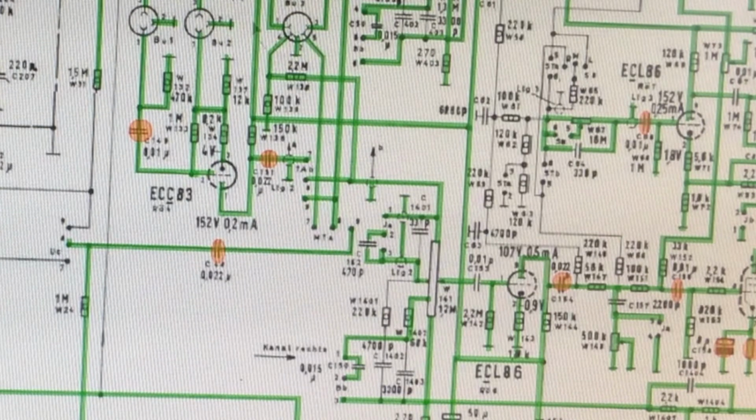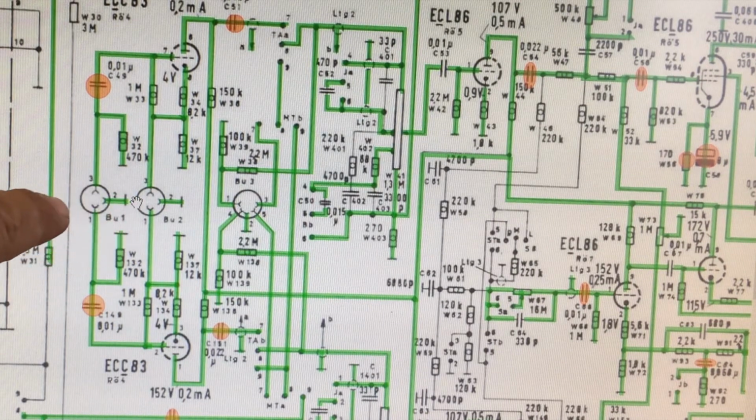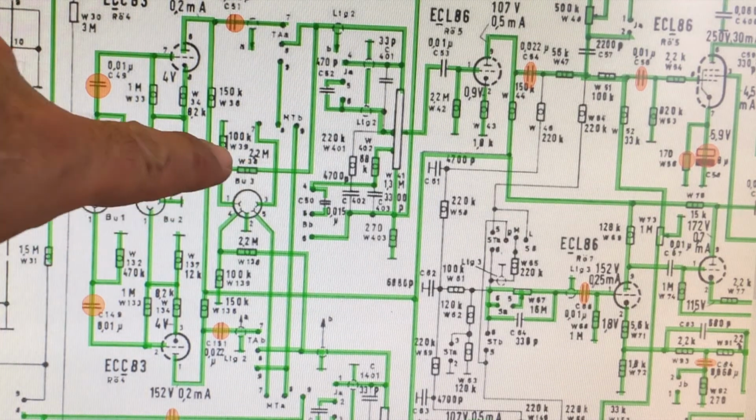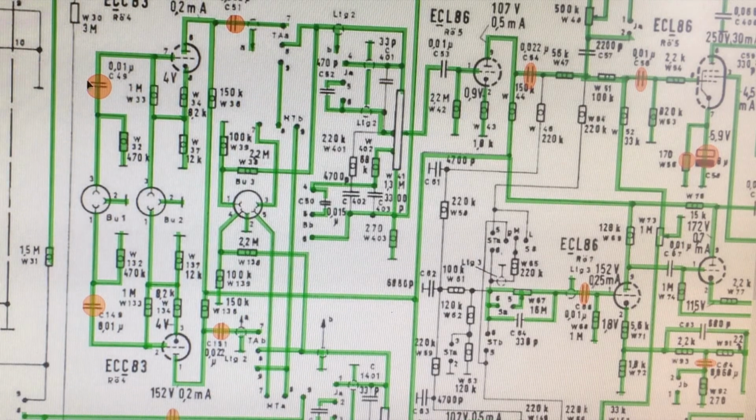Now let me show you where this all starts happening. This is the audio socket. That there is the audio input socket. That's the balance control. That's the tape. So everything comes in here, and it's basically the same left and right channel. So if you go in here, you've got a resistor to ground reference. There's that replaced cap, the one that was pretty atrocious. Then it goes into one half of the ECC83, 12AX7.